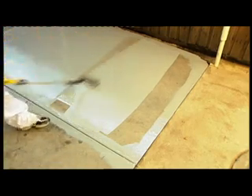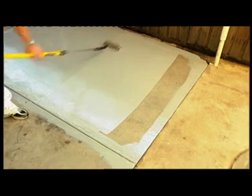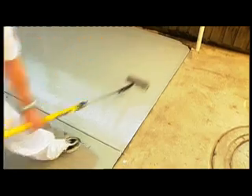Make sure the paint is applied to the surface in nice even strokes and that the actual amount of paint applied in each painted section is even as well. Continue this process until your entire surface is covered, then lay off the area in nice light even strokes with an uncharged roller to ensure there are no roller marks across the surface.